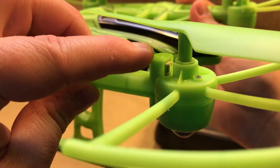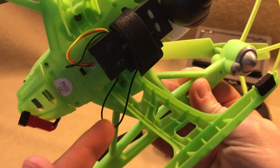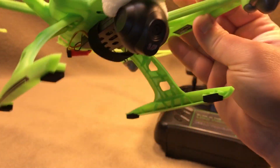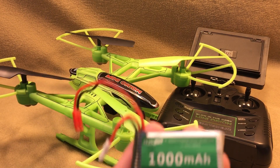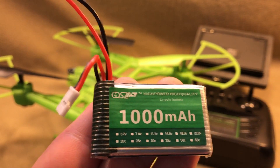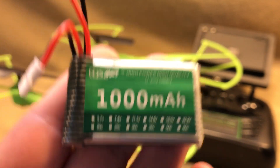Not only that, but it's a cheap drone with cheap little wiring, and I'm sure the speed controller has the cheapest possible solder ever made. So that's something to keep in mind when buying a battery. Personally, you could go up to 25C maybe, but I'm sticking at 20C since we start with a 15C factory battery.